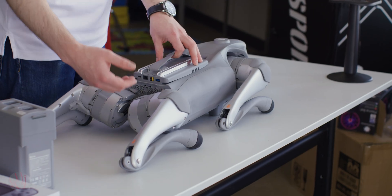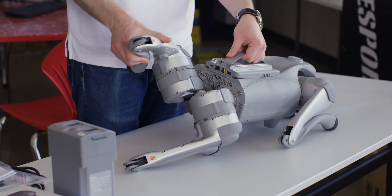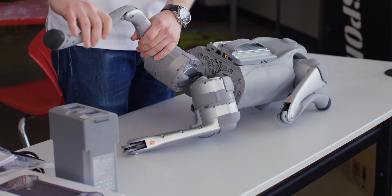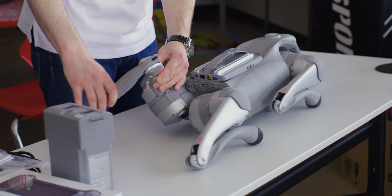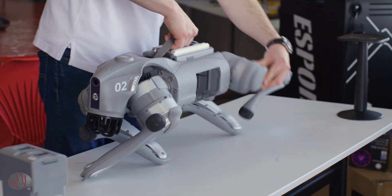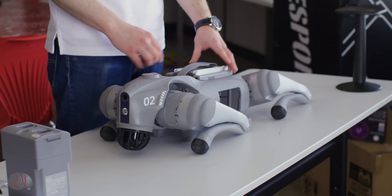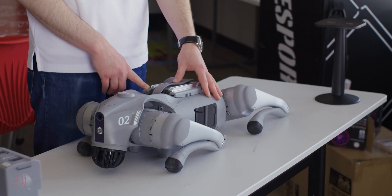Taking a look at the hardware of the quadruped, we can see four legs with a really great range of motion. I believe this has a 96-degree turning radius, 290 degrees at the thigh, and around 250 degrees at the lower leg. The dog comes equipped with four rubber foot end pieces, with four additional ones in the case. Up front we have the 4D LiDAR and the RealSense 3D camera. On the back we have an expansion dock with an Nvidia Jetson Orin Nano offering 40 TOPS of AI processing power. You can also get the more powerful 100 TOPS expansion pack if you wish.